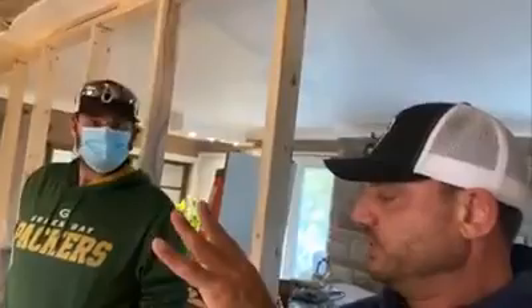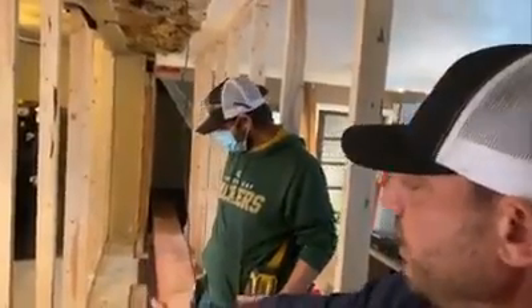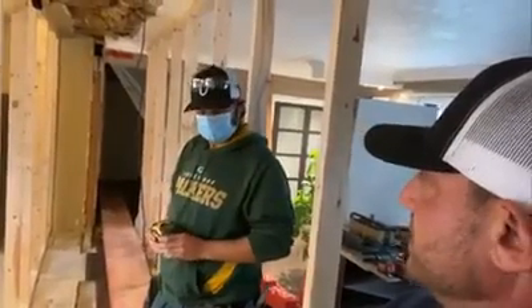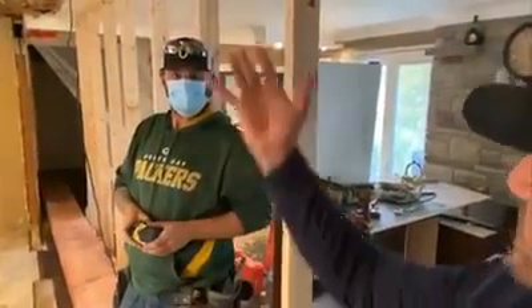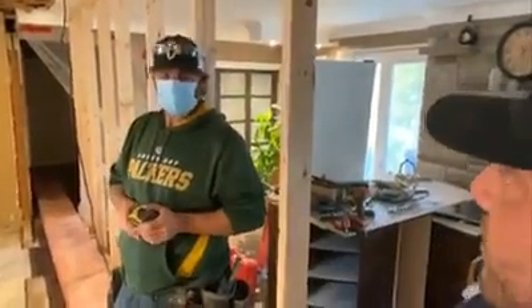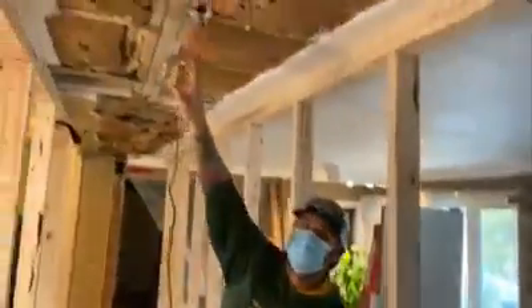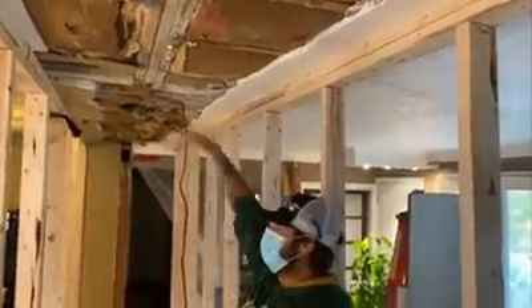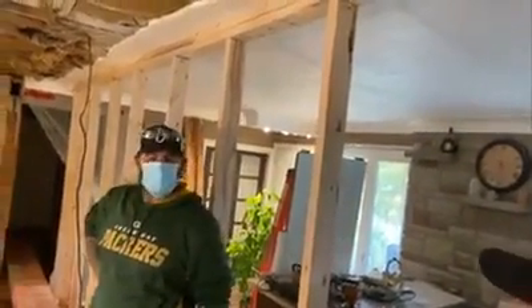I just want to kind of take our audience through this again. We've done this before. These walls here are basically supporting on each side, and the load should be down in the basement — that's correct. That load then supports basically what we're doing above. We have to take this whole section out, because this beam is actually being recessed into the ceiling to create a nice smooth, open concept main floor. And we're following basically what the engineers have asked us to do — the engineering drawing.